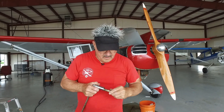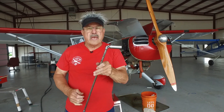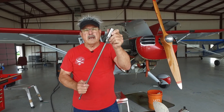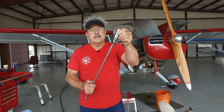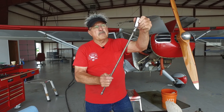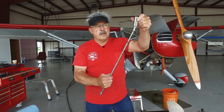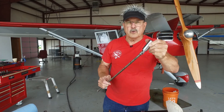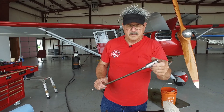Same way you can put it back in. You can use a torque wrench on a wobble joint — don't let anybody kid you. You just don't want to use a torque wrench if it's at an extreme angle. The manufacturer says up to 30 degrees or something like that. But anyway, you can use a wobble joint on a torque wrench — you don't have to compensate for anything.